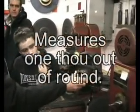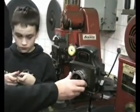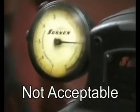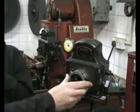See it? See how far it is? As much as a thou. Now the machining limit on that Conrod is 3/10 of a thou. That's actually quite a good one. I've seen them a thou and a half out. And it's tight right across there. Now the running clearance on the bearing is only 1.8 thou. I've just taken a thou of that away.